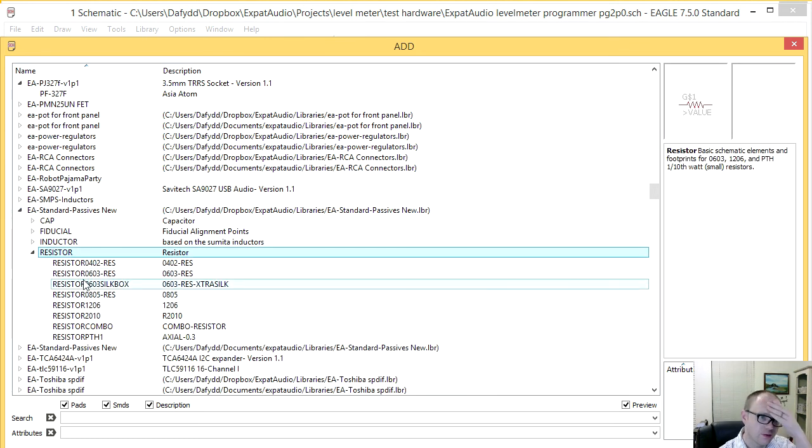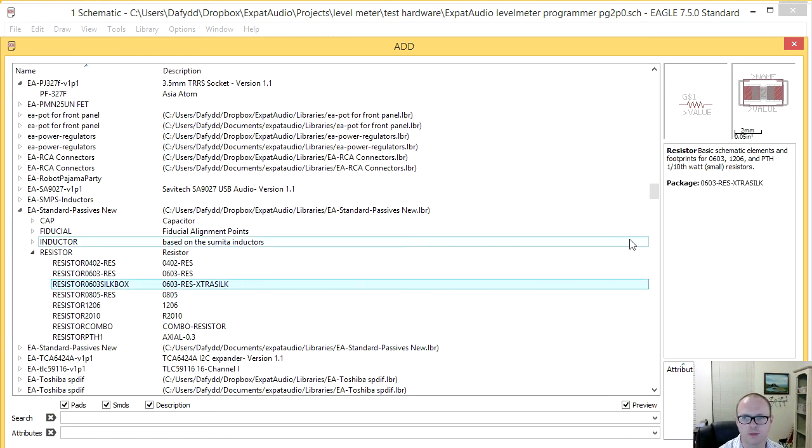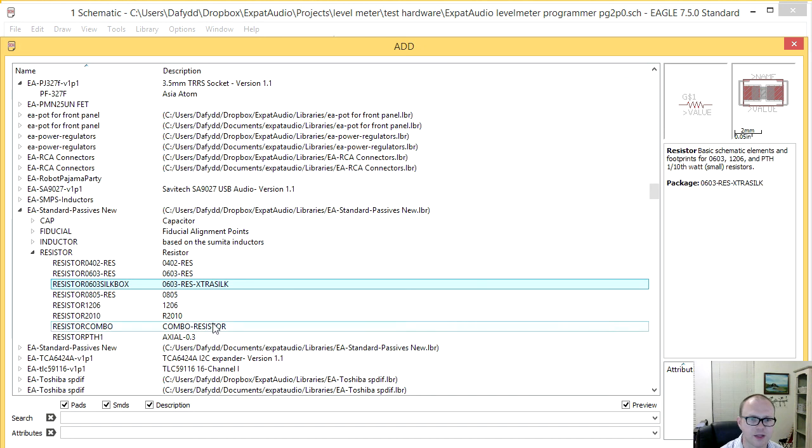Resistor. Now I use 0603s for almost everything. The only thing I added with this is a small white silk screen that goes around the resistor to help me understand which way the resistor should go. Typically, let's say I have an array of resistors, one next to the other. When I'm doing the pick and place, if I have two resistors next to each other, it looks like 4 boxes, and I may not know which orientation they go. So having that little white silk screen that basically says this is one resistor, this is the next one, really helps.